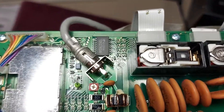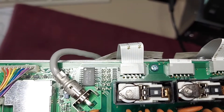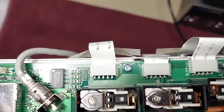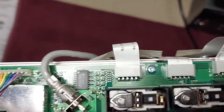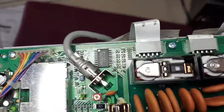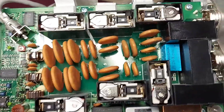I've been probing around with the scope probe and there is voltage coming out of that IC and those buffering resistors on the end — there's voltage coming off those even in the 10 meter position. So in the 10 and 15 meter positions, RL6 and RL7 should close, and they're not.